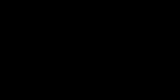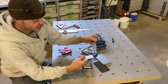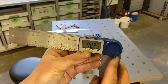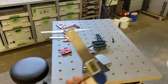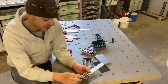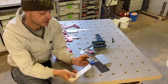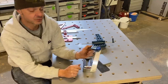Next we've got a digital angle finder. I use one of these all the time - I've got a Trend one. I've tested this against it and it's just as accurate, if not more accurate, than the Trend. It's also got an extra decimal point, so it's super accurate - 93.65 degrees, crazy accurate. Really useful tool. I set the angle on there, read what it is, lock it off, and put it up against the blade, especially on the sliding saw. Really good for doing weird angles - you can mark down what angles you're using if you need to go back and do a recut.